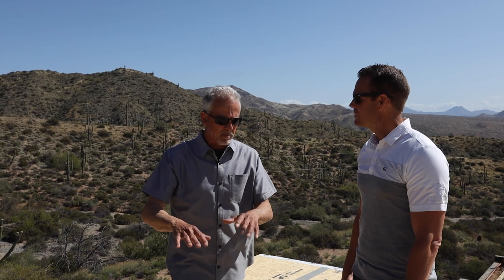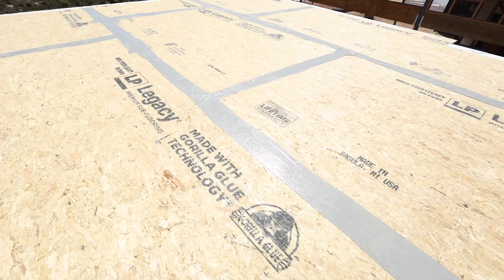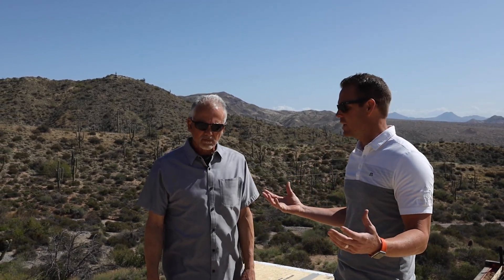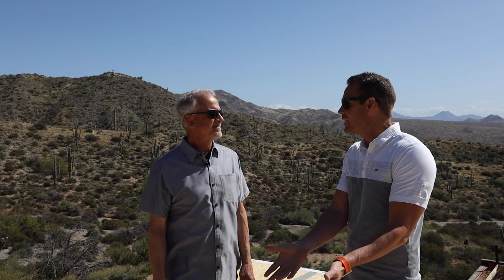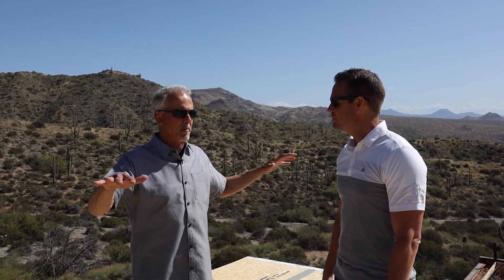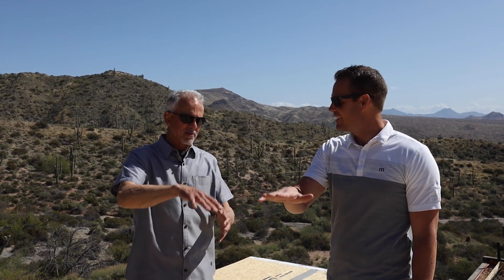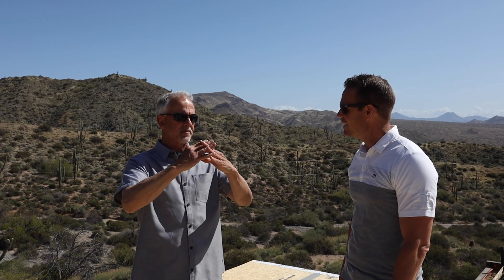In mechanical and other applications, they decided to blend a relationship with LP and Gorilla Glue to make an OSB that's incredibly tough. You can see the sturdiness when you talk about tough. Compare a normal OSB you'd buy off the shelf from any box store or lumberyard versus when it's sitting out in weather, rain, and job site conditions. It's not like you install this and cover it in one day — it takes some time. Conventional OSB 7/16s, after sitting in rain and sun, gets wet, dries, gets wet, dries, and all of a sudden those layers start to lift up.